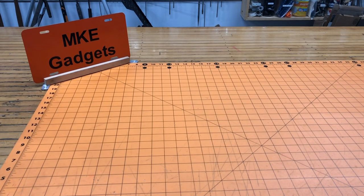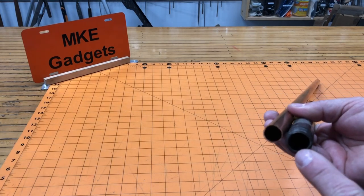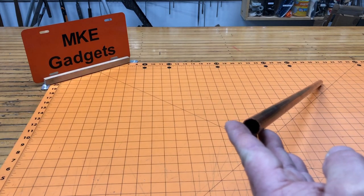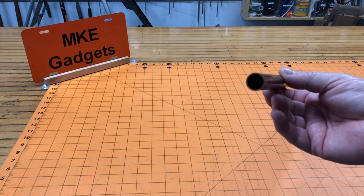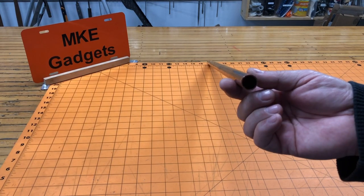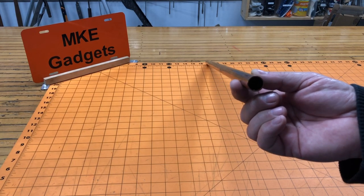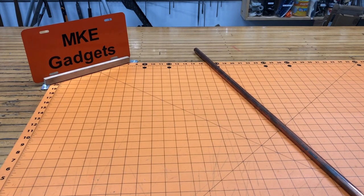Today I want to run airline in my welding booth, and for that I'm using some copper tubing. This is half-inch copper tubing, this is half-inch black pipe, and this is half-inch copper tubing. I'm gonna be using the copper to run all my airlines. Copper won't rust, it's easy to cut, easy to solder and joint, you don't have to have any special fittings, you don't have to thread any pipe. I'm gonna run the copper tubing about 30 feet in the ceiling. So the question is how do I attach this copper tubing to the ceiling? You need some kind of hanger or bracket, and that's what today's video is really about.